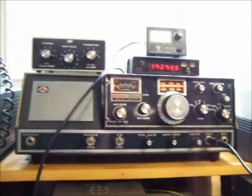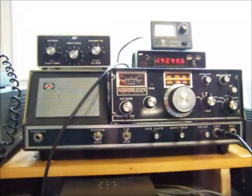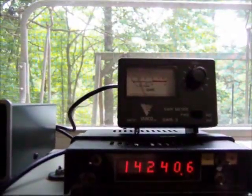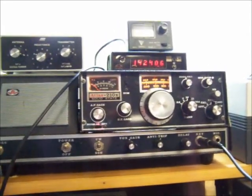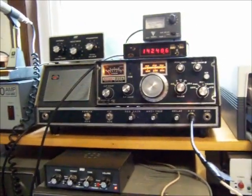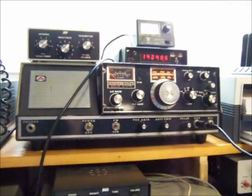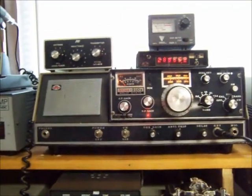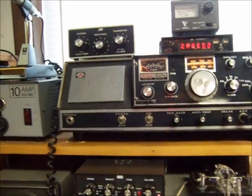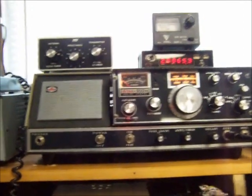The bands are very quiet today — it's a humid September afternoon. As far as tuning this thing up, I'm on 20 meters right now and I sent an ID a minute ago. Checking the meter, we're about 1.5 to 1, maybe a little bit under, which is pretty impressive for what this is. I'm pretty amazed that it can load up that well. Bands from 10 meters to 20 meters — so 10, 15, and 20 — are under 2 to 1. When I get above 20 meters heading towards 40 and 80, the SWRs get much higher.